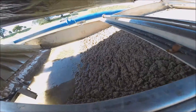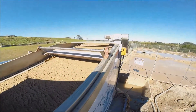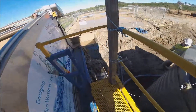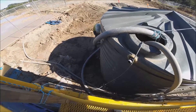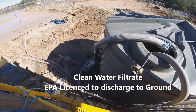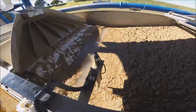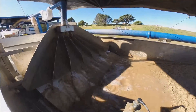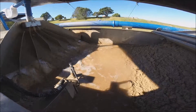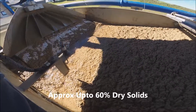You can see not much sticking to it at all. From here we can press the solids — this is where they get vacuumed and can proceed and pull over the back of the vacuum filter. So now we've got the front for discharge. We're currently running around about 60 to 70% solids and that's looking up beautiful.